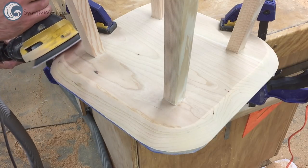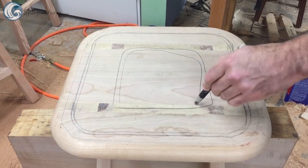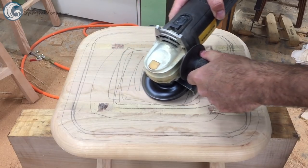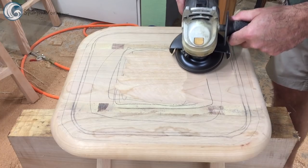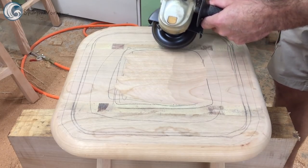Now flip the stool on its feet, mark another boundary with the compass set a little wider than before, and start in the center of the stool, working your way out. Use a sweeping motion to shape the seat, starting with a light touch to the surface and applying a little more pressure as you reach the center, then lightening up as you finish the motion. Keep doing this on both axes so the sculpting is symmetric.